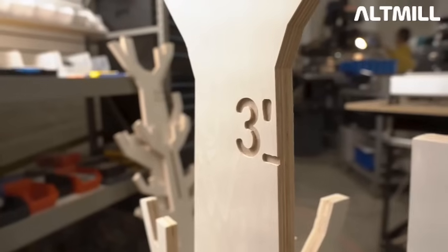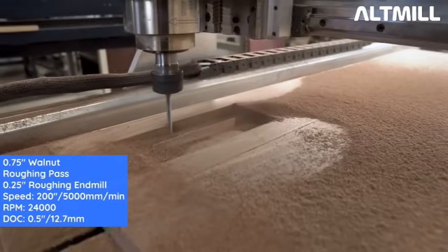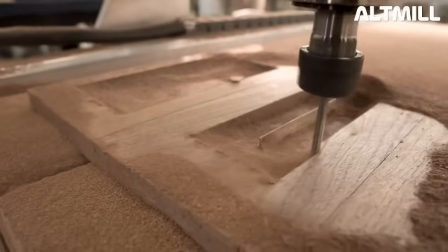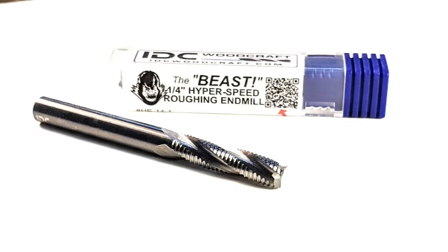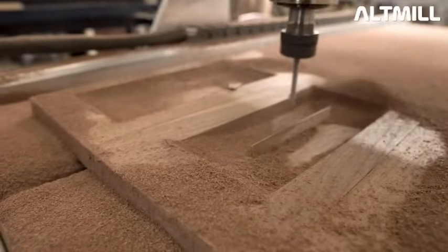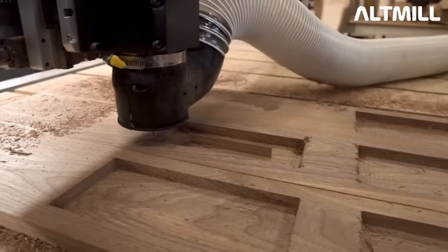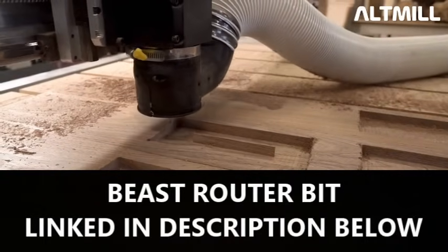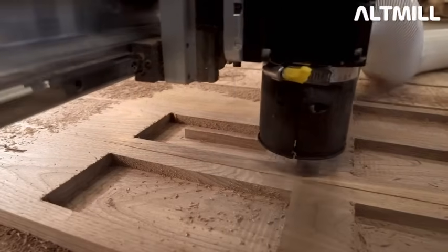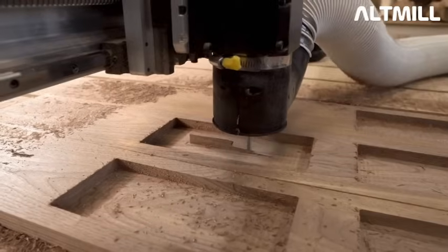It cuts four foot by four foot - half a sheet. Now it looks like they've got walnut; they're doing a roughing pass using a quarter-inch roughing mill at 24,000 RPMs and 200 inches per minute. This looks like the Beast from IDC Woodcraft - that thing is rocking and rolling through the material. The Beast is a router bit designed to hog out material; it doesn't leave the cleanest finish. You can get it at IDC Woodcraft - link below. I can tell they're using the 80% stepover that I recommend for that bit, and running at probably two to three times the speed I recommend, doing a ramp in for the final cut.